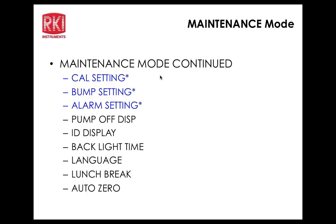What is the amount of time you can use for bump and cal? What is the smallest parameter that we can use for bumping and calling? I haven't tried that. See what's in the screen here, but you can try it. Yeah, let's take a look. Let's go back up to gas time. Yeah. Okay. So it looks like 30 is the minimum.